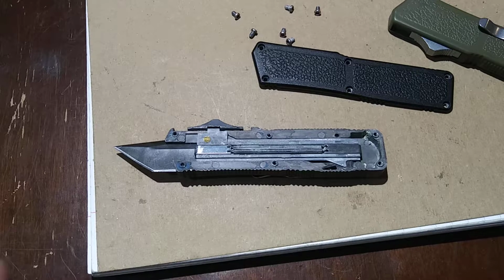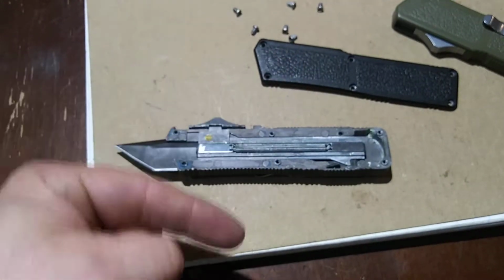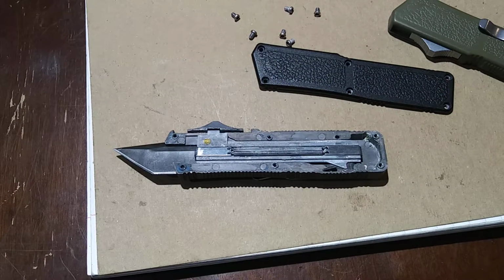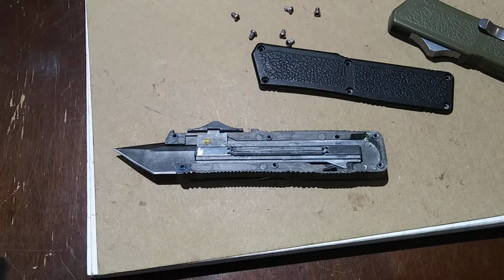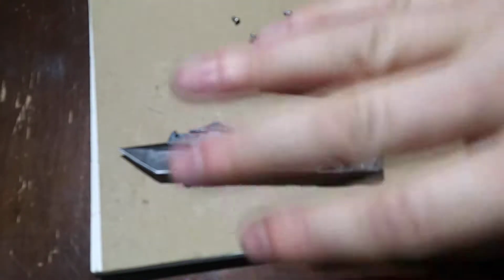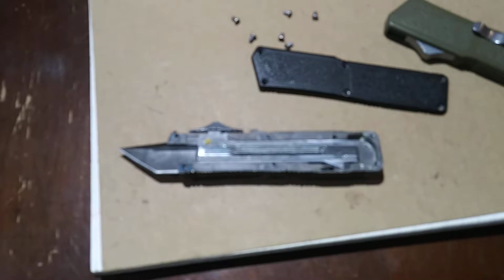And now what we're left with is there's a film of grease in between each coil of those springs. So when they snap back closed, it's not quite a shocking snap. In my opinion, we have the same energy coming back, but we've also coated them so that they can't vibrate as much. I mean, imagine a dinner bell, and you dunk the dinner bell in, well, anything, a coat of rubber, grease, whatever, and then you ring the bell. It's not going to be as loud. So that's essentially what I've done here.